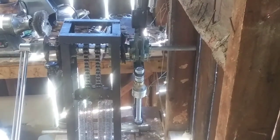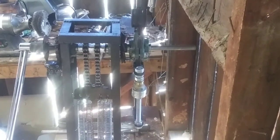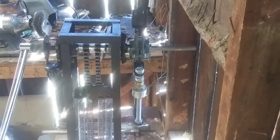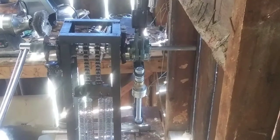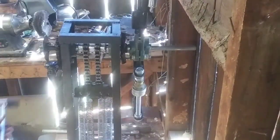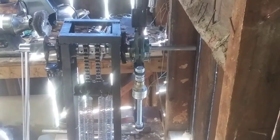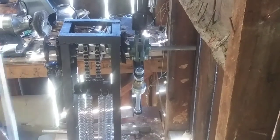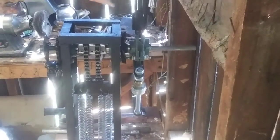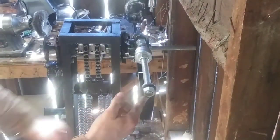Also, this is a torque wrench that shows foot-pounds, so I'm going to read how many foot-pounds we've got as I turn that. Right now we're already at 55, 60, 65, almost 70 pounds of torque. We'll check our firing pins, see if they're level. We'll go one more tick. And we're at 70, almost 75 foot-pounds of torque, and that looks pretty good and pretty level to me.